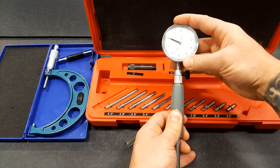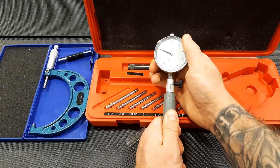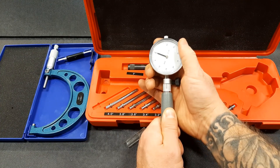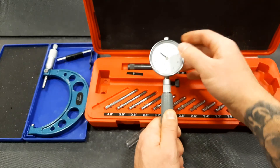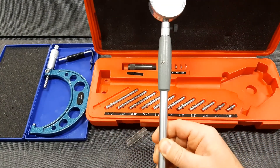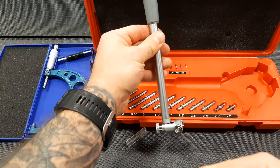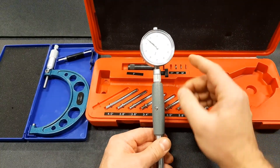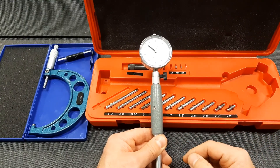We have to be careful not to go too far. What I want to do is very slowly drop the indicator in and I'm looking for that little bit of needle movement. At this point the needle stopped moving — I'm not down far enough, I want to just make contact. The reason for that is the button on the end is what's actually going to take our measurement. As this button is pushed in, a rod acts on the base of the indicator. If I install the indicator too far it's going to take the plunger to the end of its travel and I won't get an accurate measurement. So I want to keep this as high as possible while still affecting the measurement.